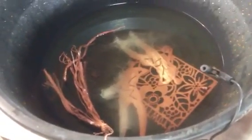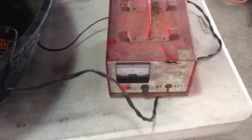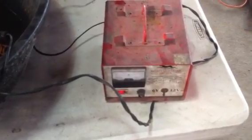This is just ordinary table salt, 4 parts water, 1 part muriatic acid that is 60% purity, and an ordinary 6 to 12 volt battery charger. We found that it is working better at 6 volts than at 12.